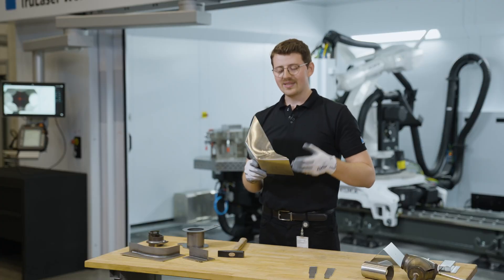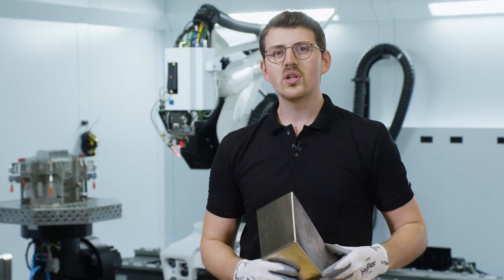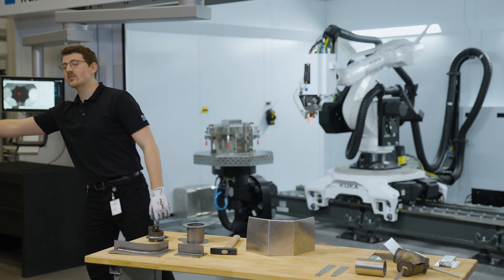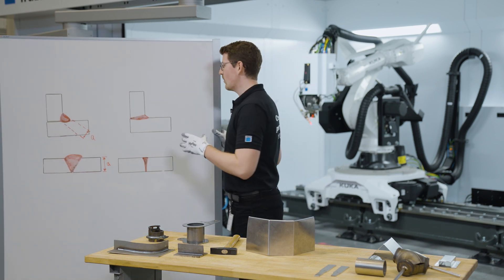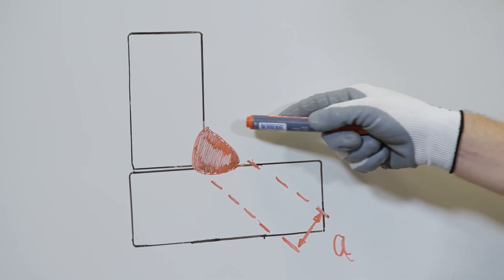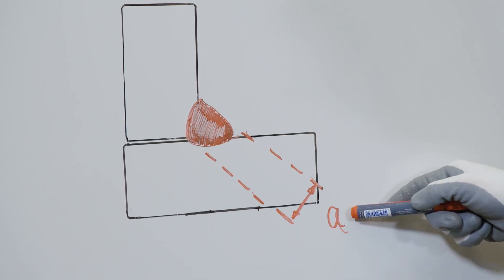And of course, the part that I just destroyed didn't break at all — it only deformed. So let's have a look at the theory and why the seam width is not the important value anymore and how strong laser welding actually is. If you look at these cross sections, the decisive factor now with laser welding is the connected area. Here you can see a typical example with the A value drawn to it.